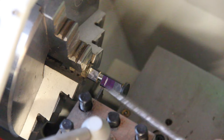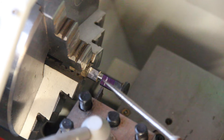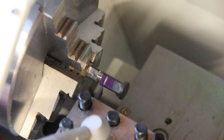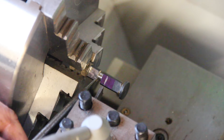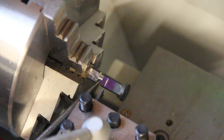I have my parting tool. You can see here's the mark that I need to cut down to. I've got this set up so it's at the right position. I've locked the carriage so it can't move sideways — it can only move in and out. And I'm going to cut in until I get to this edge here, then move it along and cut in again.